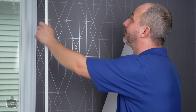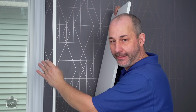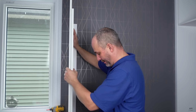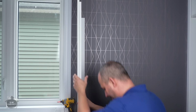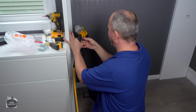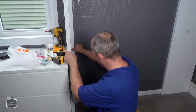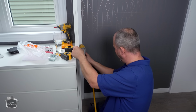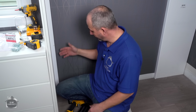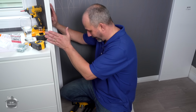So there's panel number 1, floor to ceiling, right? And again, we're not concerned about how tight it is at the ceiling because we're going to be adding caulking and paint and crown. There's panel number 2, okay? So what I want to do here is first get this fixed in place about where this cabinet is, because I know when I'm compressed this way, I can find my level from there. That's funny because this is a brand new house, and the outside of the room versus 16 inches in, it's over a 1/4 inch gap, right?